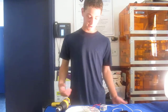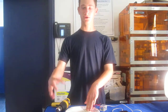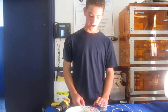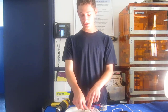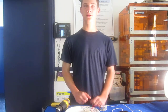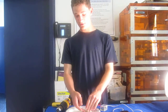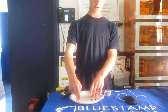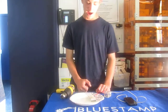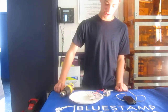The specific components that are important: I have the TEGs, which turn the heat, or the absence of heat, into electricity. So the cold side and the hot side. The TEGs generate electricity based on the difference between the cold side and the hot side. I have the cold side facing down on a heat sink, and the heat sink is cooled because of the water in the plate. Then the hot side is exposed to the heat gun and the heat generated from that.